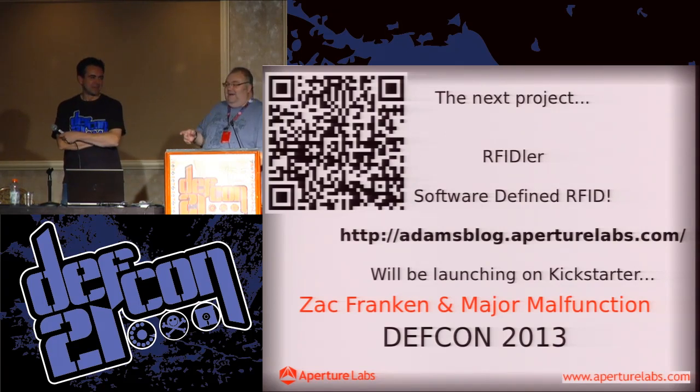In fact, a guy called Bunny Huang did, go have a look at his blog, a little demonstration. It was fantastic. He hand decapped a PIC chip, and he masked out. He worked out where the fuses were, and realized that the fuses had been covered by a little metallic gold plate. He realized that, okay, you're covering it with a plate, but there's still a passivation layer in between the plate and your actual fuse, which is effectively a transistor. So if I mask out all the other UV sensitive parts of the chip, and put it at an angle, I can get the UV to bounce under the shield and just cook it and discharge the little transistor, and he could read the data right out.